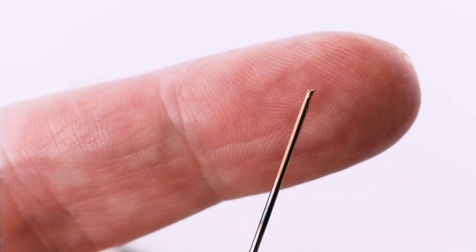The details, the overhangs — everything is difficult and it's so small you can barely see. The smallest tool in this range is 0.2mm. You can imagine that on a 0.2mm tool, if something went wrong in the process, you don't see anything. But three hours later when it's finished and you go and check the part, the part is not done — maybe you have a broken tool and you don't even know.